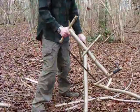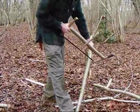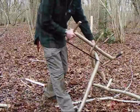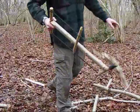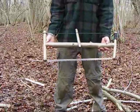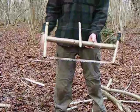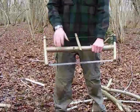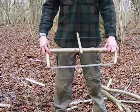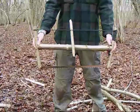You can get more tension on the blade on this than you can on the bow saw that I made earlier on, so you can saw quicker and stronger. This is a very quick rough version that I made — it took me about ten minutes. But with time you can do a better job of this, make it a lot nicer. You can remove some of this centre material here because that's quite weighty. You have to leave these big ends in place to give support to the uprights. There we go — folding buck saw.